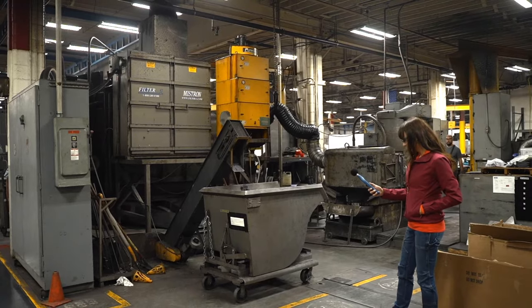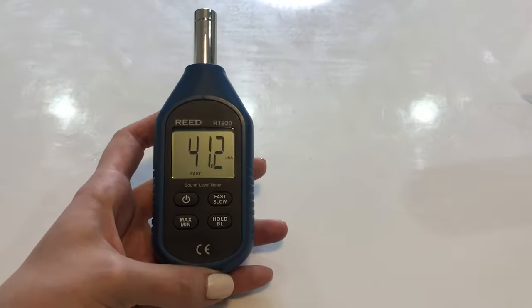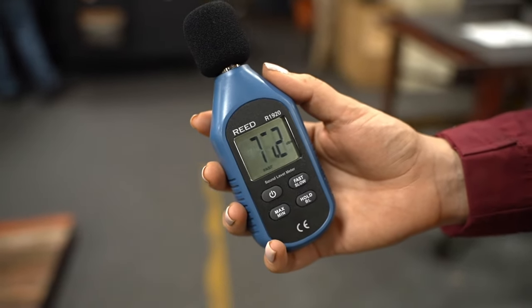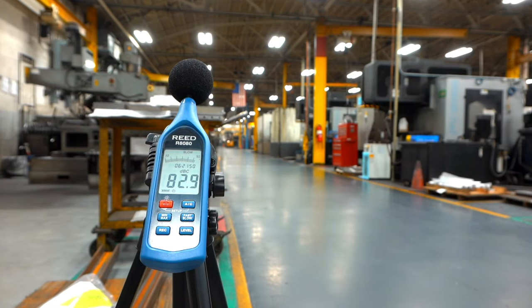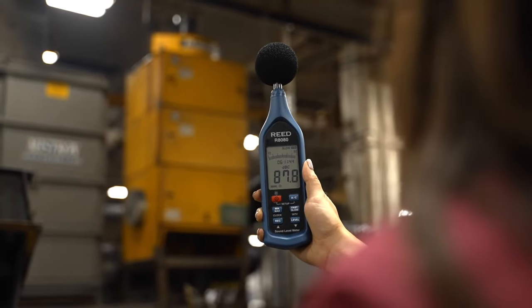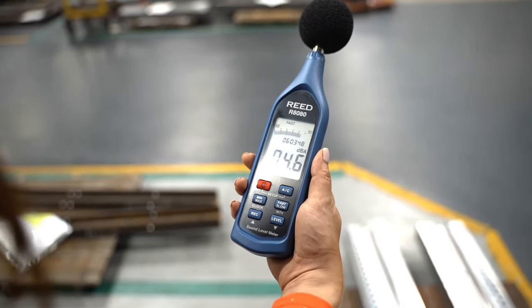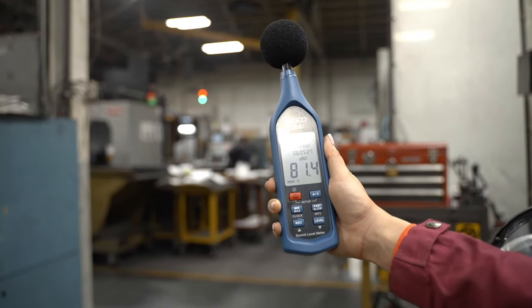To get a good idea of how loud your work environment is, start by performing a walk-around survey — noise survey step one. Sometimes when I just want to do a simple preliminary survey, I'll start with a small sound level meter. It's easy to keep in a coat pocket or bag. A preliminary walk-around survey is the first step to identifying where there are noise problems and should be done throughout the entire facility. Do this during normal operations, and if you find noise levels are 80 decibels or more, additional sound surveying is needed. I find this works best if you bring a facility map and write down each area's average noise level.